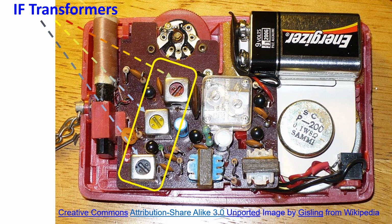That is done by turning a screw mechanism on top of the IF transformer, like the way you change the value of a preset potentiometer, as in changing the output voltage of a power supply. This needs to be done only once after constructing the Superhet receiver. As the Superhet works at a fixed IF, further adjustments are not needed while receiving each station.